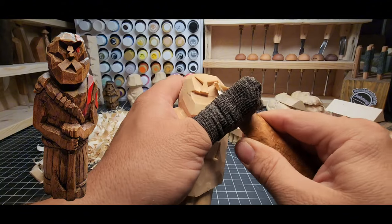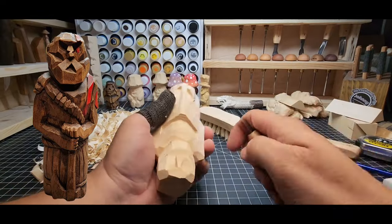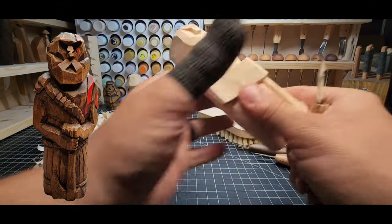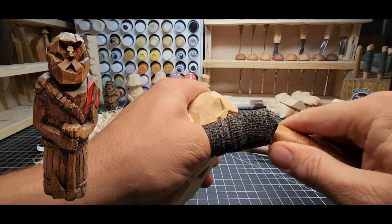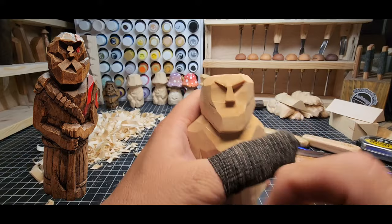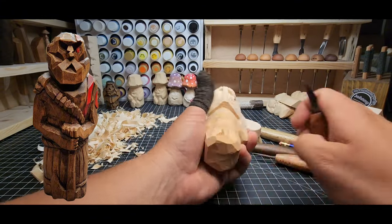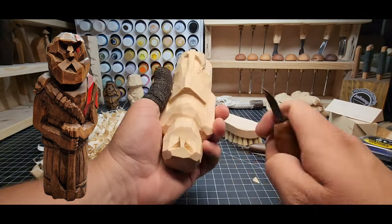You can see on the overlay on the left that the shadow creates a good look for those eyes. We're going to take these cheeks out afterwards, flatten them out to the same plane the other side of the nose is, and then get some more depth in on the eyes. Just take a little bit of time — you don't take it all out at once, a little bit at a time. There's no rush. Then let's get some more depth on that eye — go back in with our stop cuts and angle a bit more, a bit deeper. It kind of slopes up into the eye. Look at that shadow — that's fantastic.